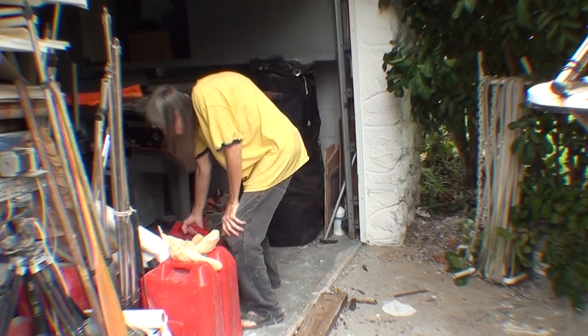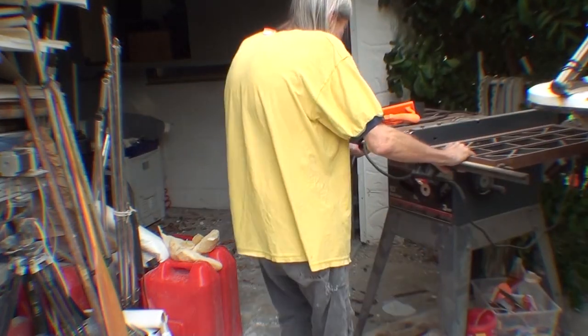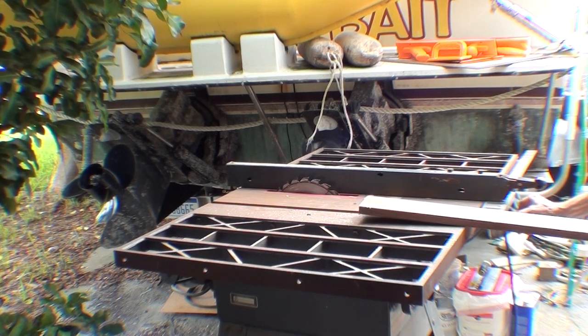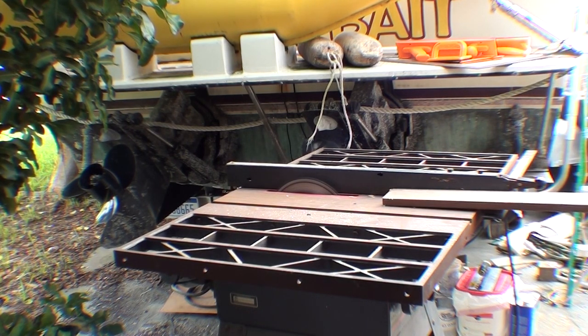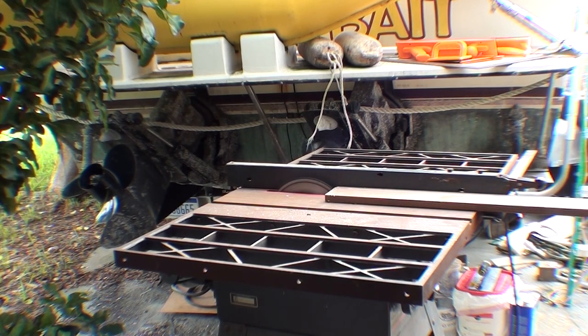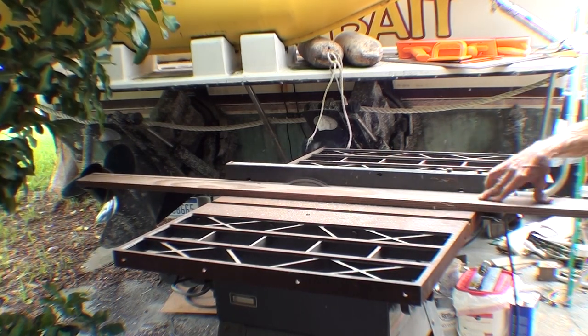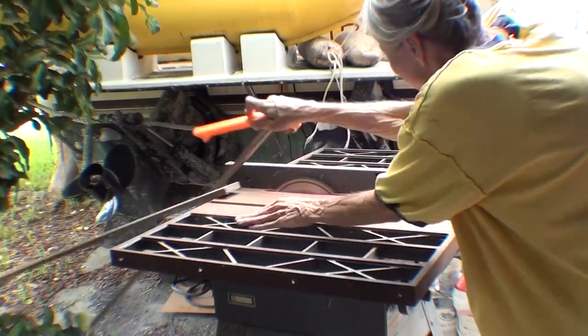There must be a million ways to attach screws, bolts, or hardware to honeycomb panels, but there are no easy or good ways. The way I've chosen is to put a wood inlay into the honeycomb, and then I can attach screws and hardware to the wooden inlay.